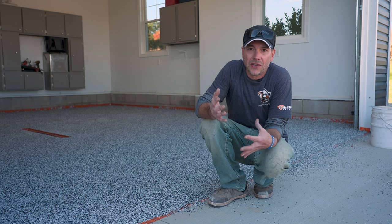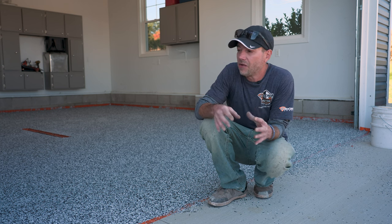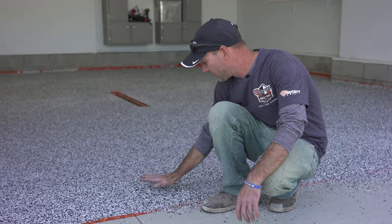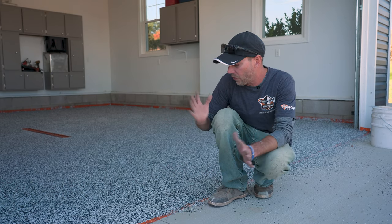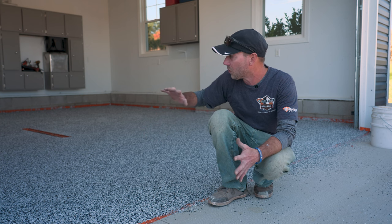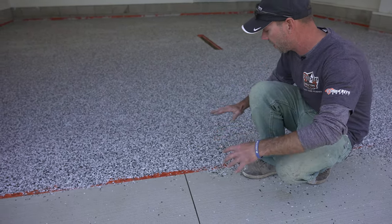It's been about two hours since we put the coat down and threw the chips — that's a pretty good time to check. That's about as fast as this coating will ever go: an hour and a half to two hours. Depending on the weather and air movement, it might be three to three and a half hours before it's time to scrape. Two hours is always a good time to check. With all these chips, we can't feel the coating itself to tell how tacky it is, so I always go to where we started — not where we ended — to check.